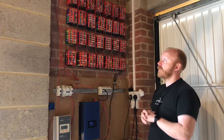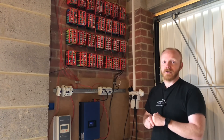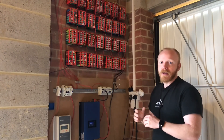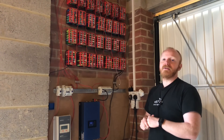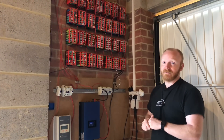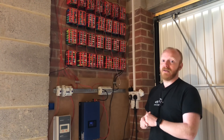It would be nice to get an at-a-glance view in Grafana to know what the usage is throughout the day. At the moment all I can see is the output being used on the charge controller — the garage lights and a few other miscellaneous things. So this video is about how I got around that issue, which was to install an ACS712 current monitor. I've been told there's a newer one, the ACS720, but I cannot find any boards with it, and the ACS712 is the more popular and extremely cheap option at the moment.